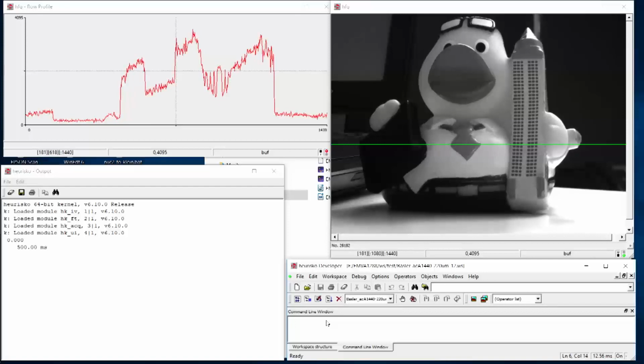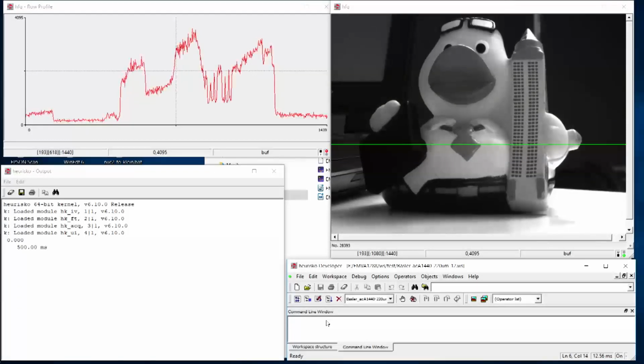But obviously what we have to analyze in detail to judge the quality of a camera is basically how much noise I have in relation to the signal. And obviously it also changes with the gain. So I have less information from this object now, but more noise because I have increased the gain. So this is one thing we have to analyze in much detail.